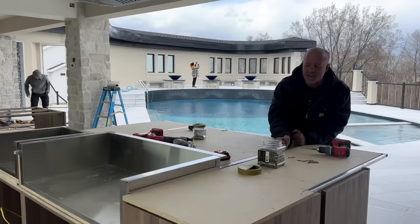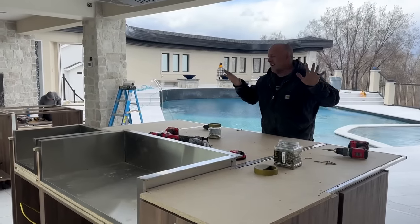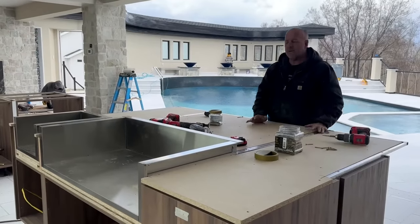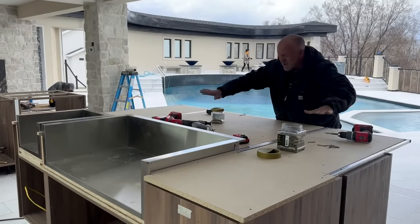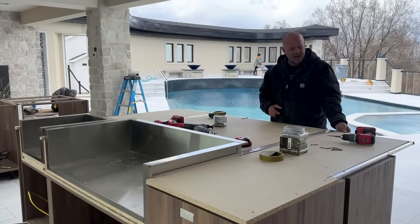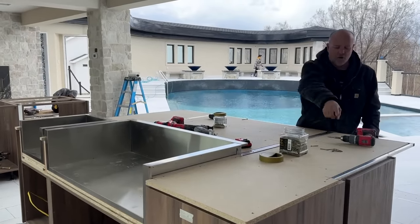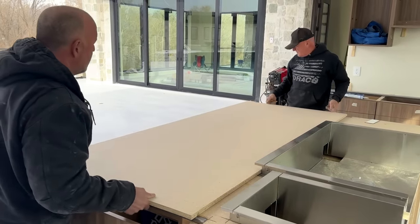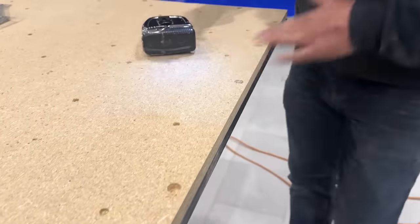There, the steel frame's in, it's bolted down. Now that I've got this bottom layer done, which is all cut up for the steel frame, the next layer will be a giant sheet that bridges across all of the steel, 3/4 inch thick, and I'll glue joint everything. I'll put wood glue on this layer, so I have 2 layers of 3/4 inch glued together, screwed together, and this just locks it all in.